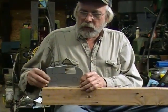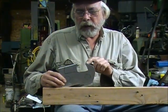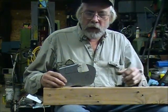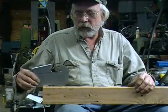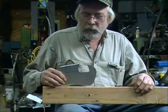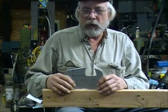When this cutter is going down the bar it comes in contact with wood. It's going to rock backwards a little bit until this stops it. Then the power of the chainsaw pulling the chain is going to rip it on through and pull it right back out of the wood. It continues to do that, swimming like a dolphin all the way down the bar. That's all great when the chainsaw chain is new and you use regular fixed static depth gauge settings.